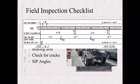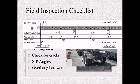Make sure they're there. Also, for your exterior beams, you want to make sure you got your overhang hangers. Right here, these were designed at 4 foot. Typically, you want to see your overhang drawings come in before the shop drawings for the beams, because those overhang drawings will determine the spacing of these hangers. Finally, check the specifications for all your dimensional tolerances. Check that in the spec book. That'll kind of make sure you've got everything you need.